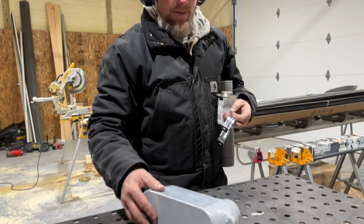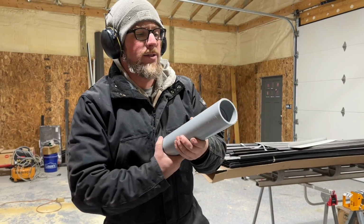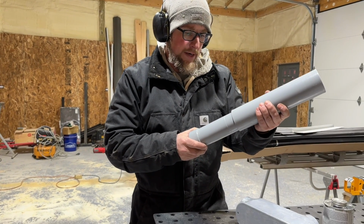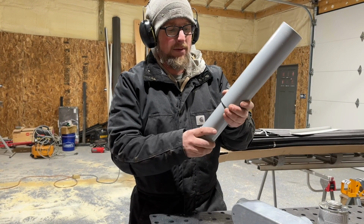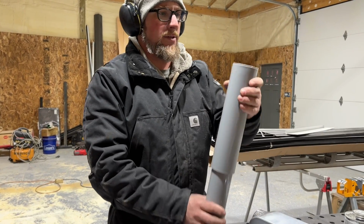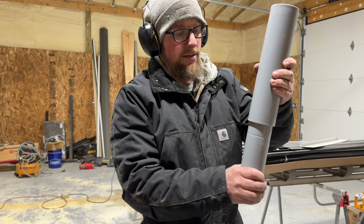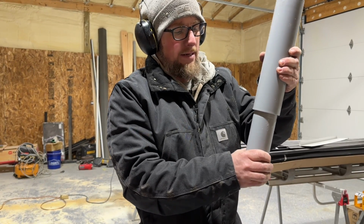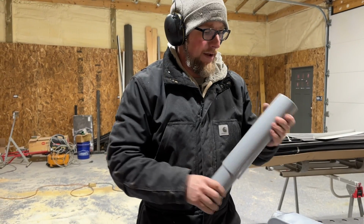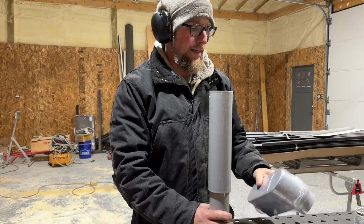All right, we're gonna need an LB, some glue, a clamp. Then we need a 2-inch expansion coupler. So we gotta set this right here on this line, which is the midpoint. So this will go on the building. And the reason you want an expansion coupler is so if the building goes up and down with the frost, this can go up and down, and it's not going to pull your pipe out of the ground. So we gotta have this. I'll have to get a small piece of pipe for whatever height we need to connect that to.